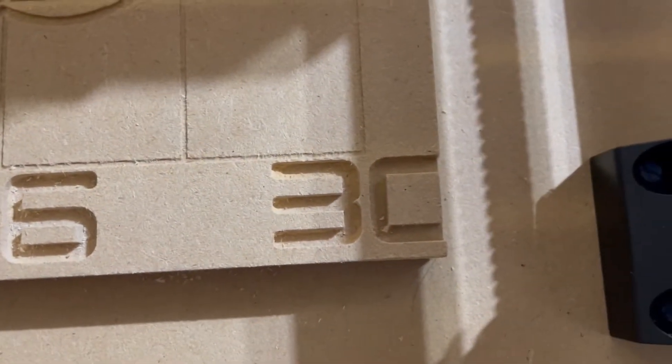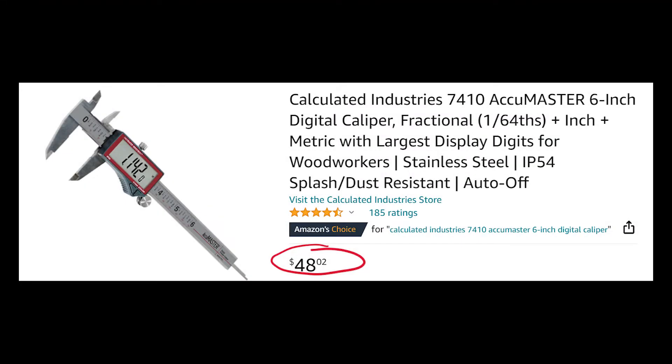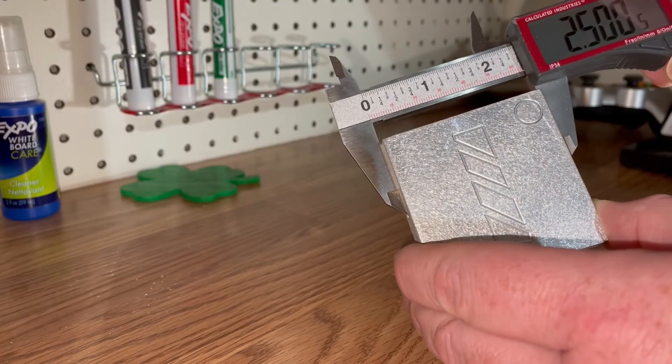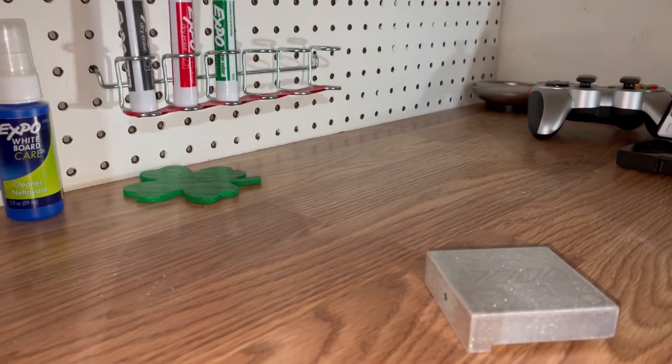You can see how being just a little bit off is now permanently on display on this waste board. So what was my mistake? I just accepted that the pre-programmed dimensions and measurements would be accurate within the CNC program and I didn't double-check. Turns out the probe dimensions were just a bit off. That combined with my measuring likely being a little off, and yeah, things don't cut like you planned. So how did I fix it? I bought a caliper. My buddy Dan suggested I get a Mitutoyo — I looked up a cheaper caliper online and got it in the mail a few days later. I updated the size of the probe in the Onefinity, which was really easy to do. I also began measuring my cuts more precisely. And just like that, problem solved.